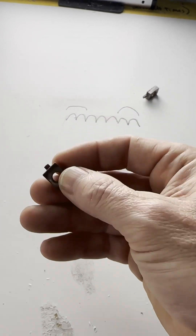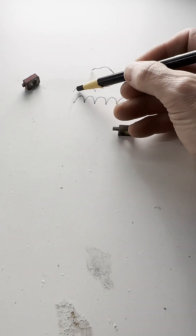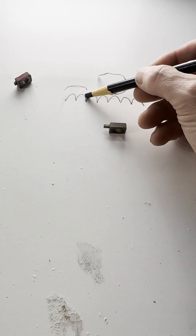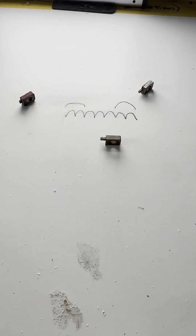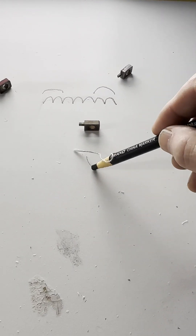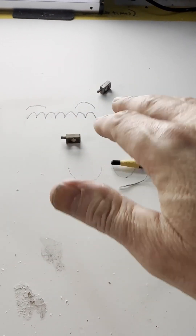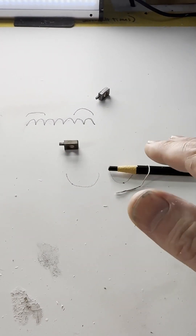It's got a broad, flat surface to it, and it makes a cut like this. When this cut overcuts this cut, we're actually using the flat section up here to knock down some of the peaks and smooth things out, and the linear interference creates good release points. With crossing structures, the release points are in and out of the base, and what we want is more horizontal release instead of all this vertical — we want the ski to hover.